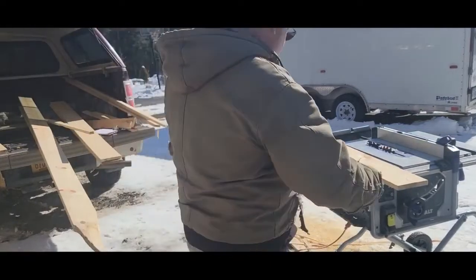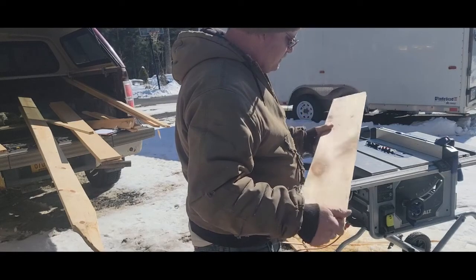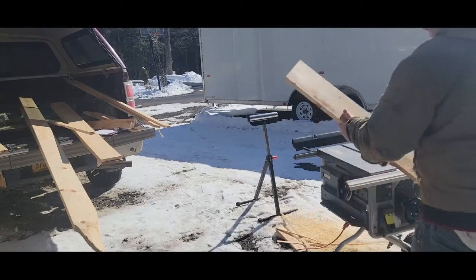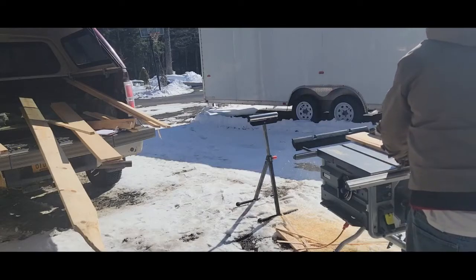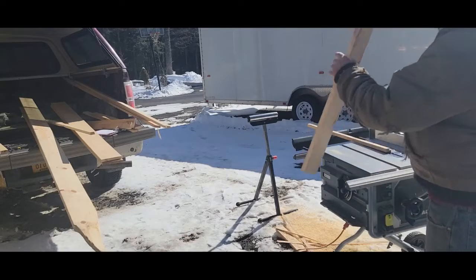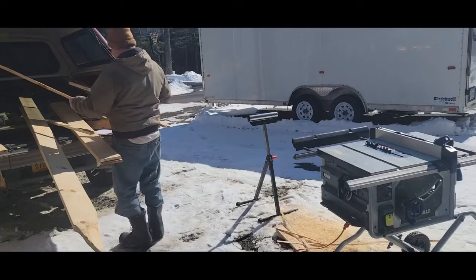I decided to cut this other one because we had the saw marks in it from a previous cut somewhere. A little bit of damage on this side. So I think I'm going to cut probably this side off, and I'm going to make the jambs. They're going to be 4 9/16 for a 2x4 wall. And then I might run them through the planer once just to clean them up, because they got footmarks on them, people walked on them at the store, pencil lines on it.